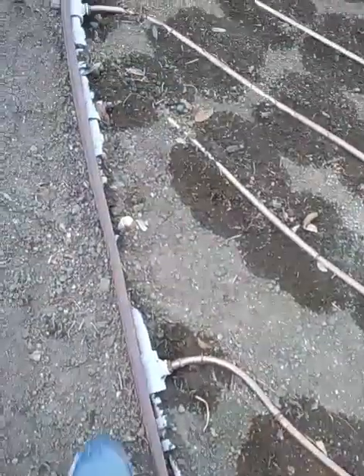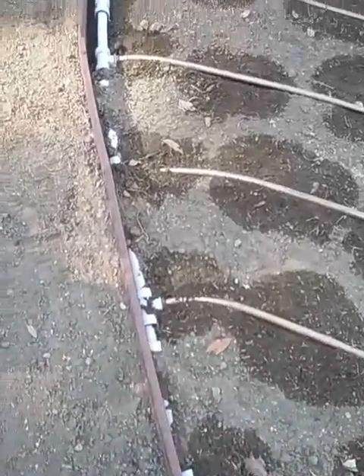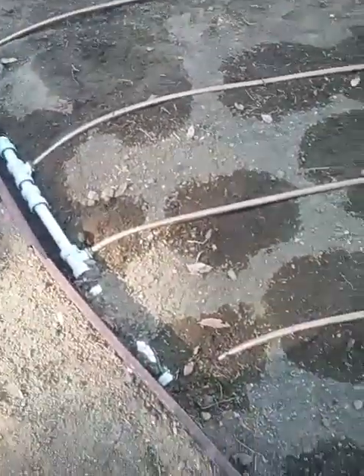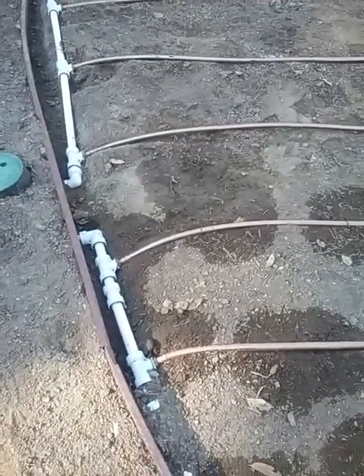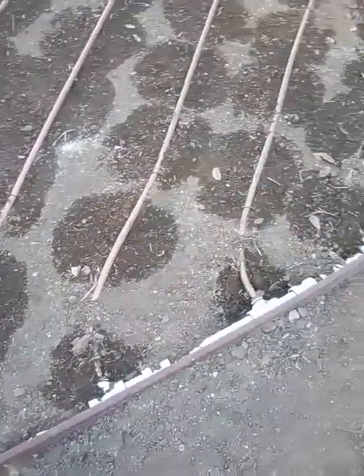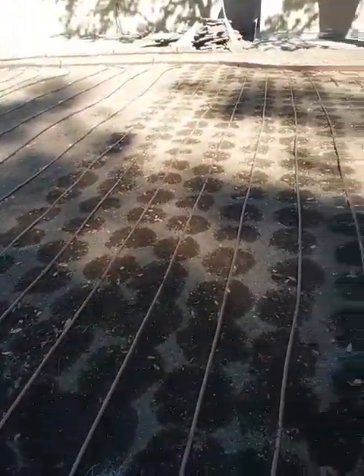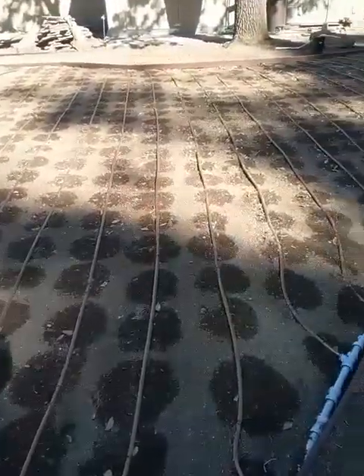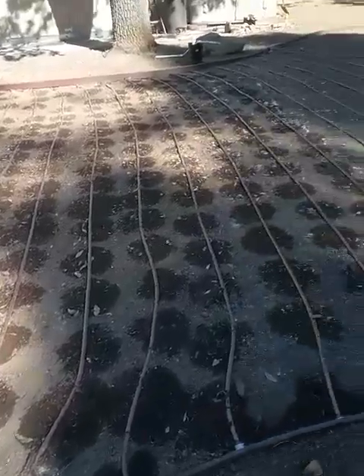There are a couple of areas I had to cap off. We ran the drip emitters two to four inches away from the edge of the bender board header, so we get a wetting pattern up against the edge. And you can notice here we have a much better wetting pattern — and this is only after about 10 to 15 minutes of watering with the system on.